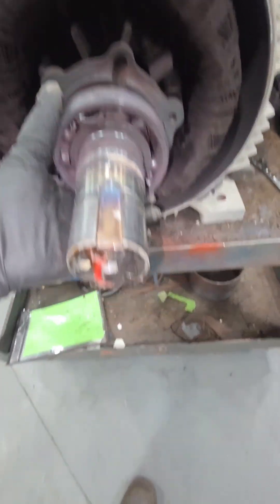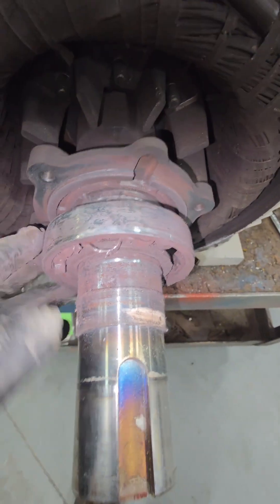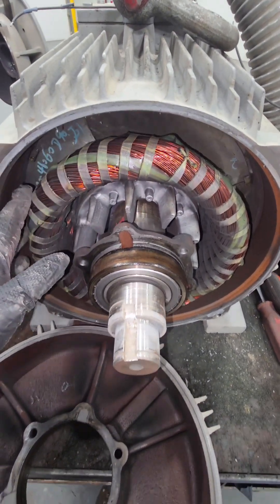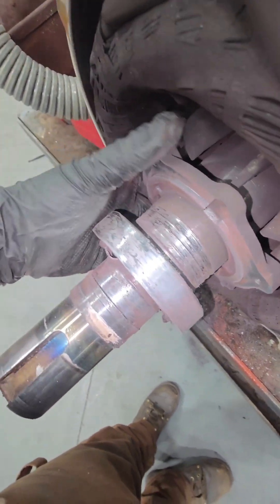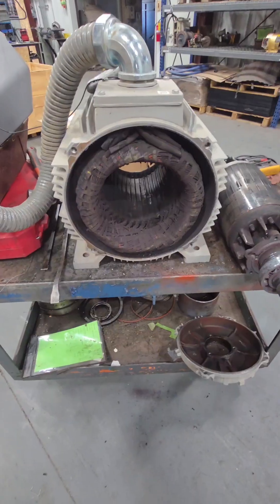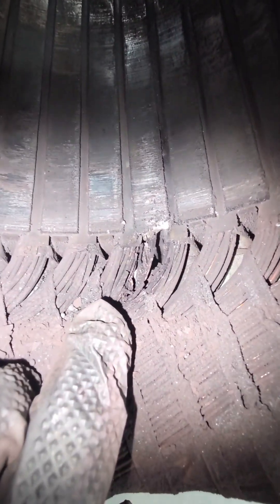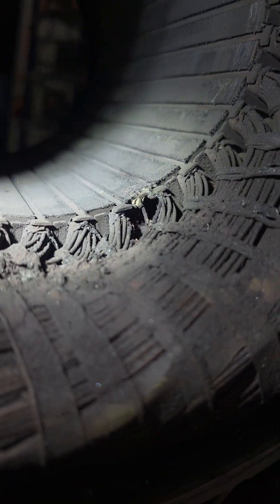I know what you're thinking — why not just throw it out and buy a new one? I'm not the one that makes those decisions. They'll get a price to rebuild it and a price for a new one. I will say, whoever stuffed the coils in this motor did a pretty clean looking winding — I like the way the phase paper sticks out between each of the phase groups. The bearing spins freely on the back end. There are a bunch of issues with the shaft — you can see metalware damage and bluing of the steel, meaning it got extremely hot. The drive-end bearing failed, that rotor dropped inside the stator, made contact, rubbed, and ultimately blew the winding — you can see right here the slot where the winding blew out, and there are copper balls in the bottom of the frame and on the outside of the stator.